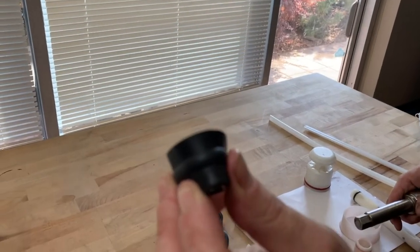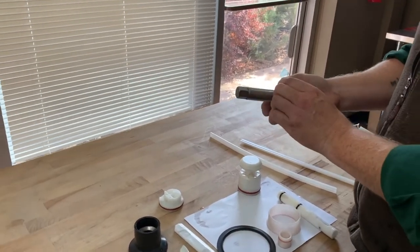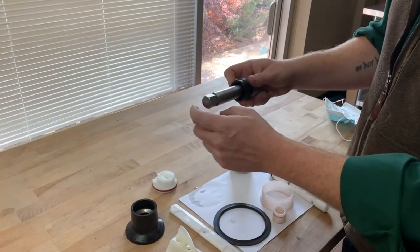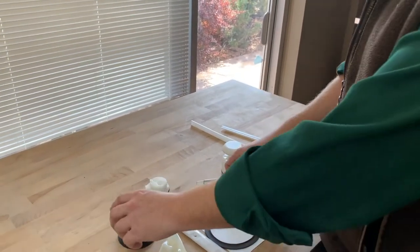If you look closely at the rubber, it's beginning to get a little weird, and there's not as much spring back as we'd like. On these, the Taylor ones go in the drive bolt, and you put lube into here and then to the end here, and you don't put lube on the hex head. But this is your first line of defense in keeping the inside or mechanical part of your machine not damaged by product.